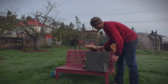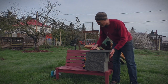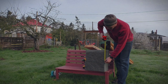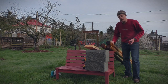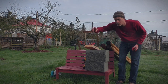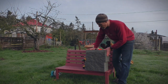These blocks weigh about 35 to 40 pounds. They also come with lids of the same dimension, and you can cut them with a special concrete blade in your skill saw — do 45-degree corners or whatever — but we're just going to do a nice square rectangle. With a lid on top, going just one high, you get about 9.5-inch sides. The price on these is about five dollars per foot, so a 34-foot perimeter comes in close to $200. They're heavy, but they look really nice.